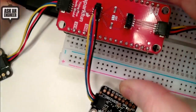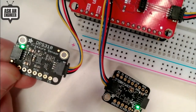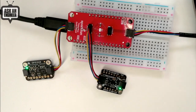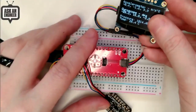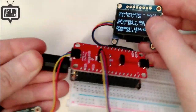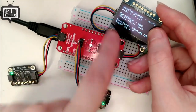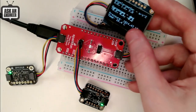What I like is that there are four plugs. Even though our STEMMA QT boards and QWIIC boards are often chainable, what's nice about this is you can connect as many as you like. So here we've got a humidity sensor, an accelerometer/gyro, and over here an OLED — it's all plug-and-play. You do have to solder headers onto the Feather Wing and plug it into your Feather — I have an nRF52840 Feather here — and then you can plug and play all of our sensors and displays. This is shown with Arduino but it works in CircuitPython as well.